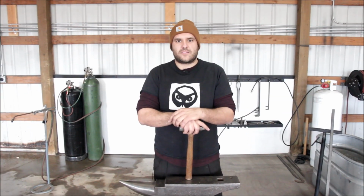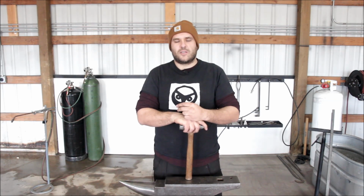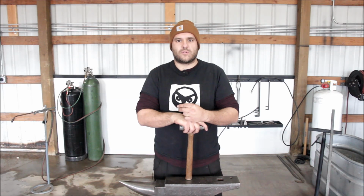I am Tim, and in this video I'm going to talk about punching holes. This technique involves heating the material to forging temperature and using a punch and a hammer to create round, square or other shaped holes. This technique was more relevant before the advancement of metal drilling tools, but still in use by blacksmiths who want to use more traditional methods.